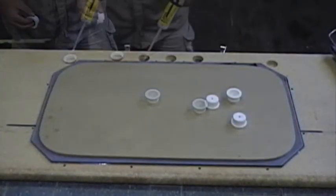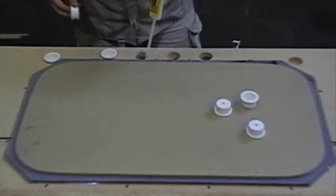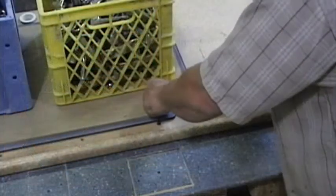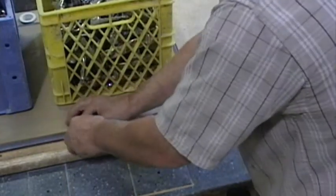Apply approved adhesive to the faucet sleeves and insert them into the substrate. After the adhesive is applied and the parts inserted, take the gluing template and place on the flanged ring. Place a weight on top of the flanged ring. While waiting for the adhesive to cure, screw the inserts into the substrate by hand using an Allen key.